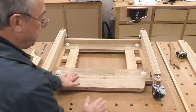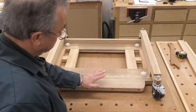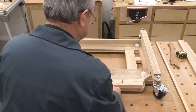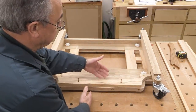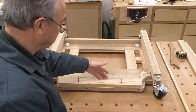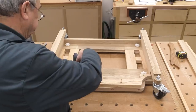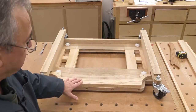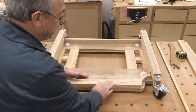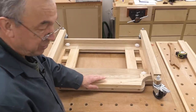This is the way it would be when you lift the planing machine into position. I'm going to walk it on bit by bit like so. There's no impediment for its journey going this way. But once it's in position, I have this piece which will fit in like so, and this will act as the retainer for the machine. I've been quite generous and cut this fairly large because I'm not exactly sure how big the machine is this way, but that should be enough. This then just screws down into place. That will stop the machine coming away and also serves to reinforce this front arrangement, making it just a little bit tougher. And that now is really strong - it will easily take the weight of any planing machine I could ever dream of owning.